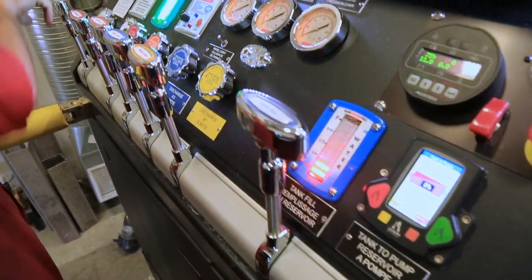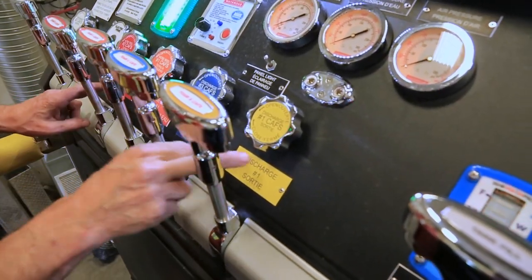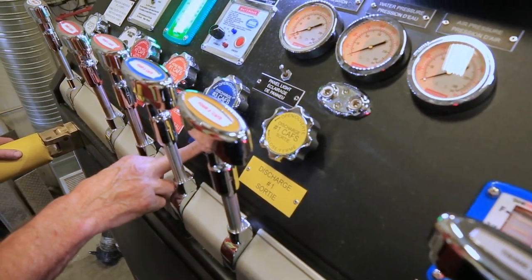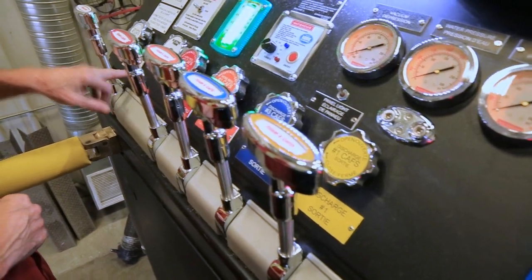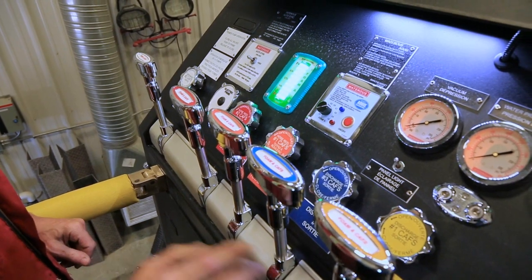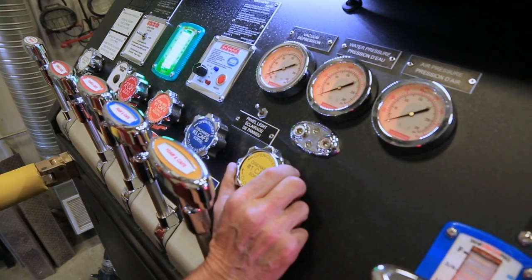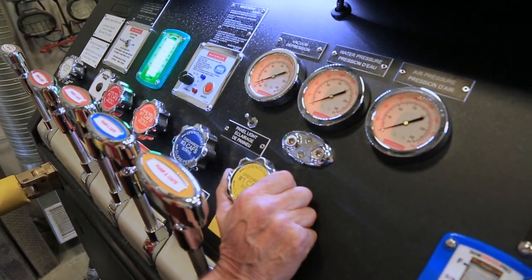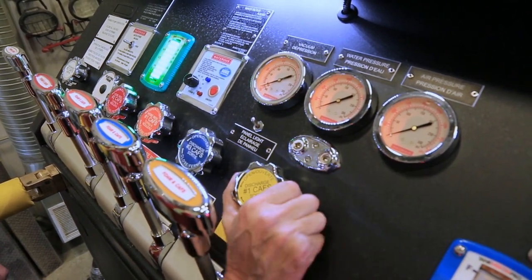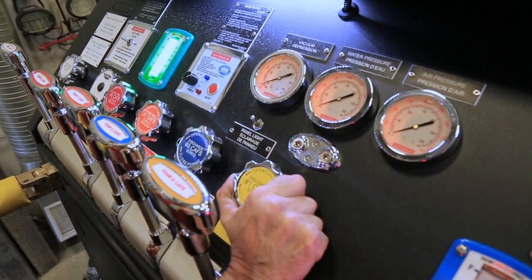All the levers for the discharge are the same, and they're all marked with which discharge is which. Discharge one on the road side, discharge three on the curb side, discharge two on the rear, and the two hose reels on top of the truck. Each valve is for water. Next to the valve for water, there is a knob to increase and decrease the amount of air going to each discharge when in CAFS operation. Simple quarter turn to fully open and fully close.